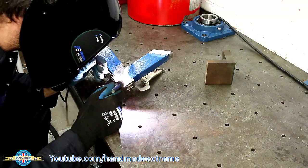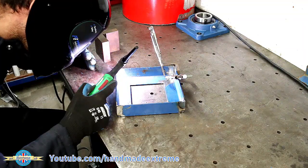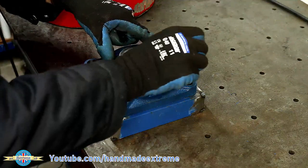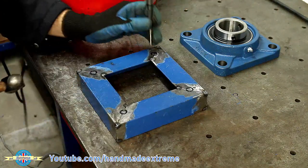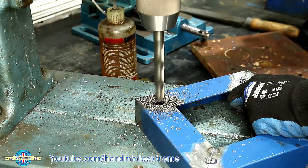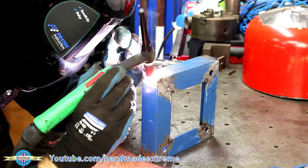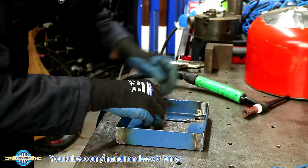I'm just using the little angle plate trick I used in the lathe tool holder video for squaring up the corners. With that all tacked up I could then put the bearing on top and just transfer the holes over. I haven't welded the whole thing at this point because I'm going to be drilling through what would be a weld line. Nice deep center punch so that the drill finds its mark — I don't want the drill wandering. I could then drill those through at 12 millimeter so the bolts are a little bit undersized on the bearing blocks, giving me a little bit of room to maneuver, and then just weld the corners up fully again at opposite corners to try and keep everything nice and square.